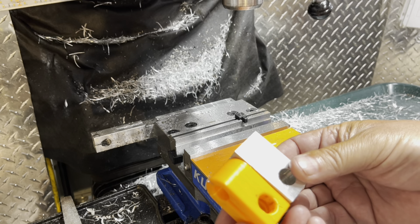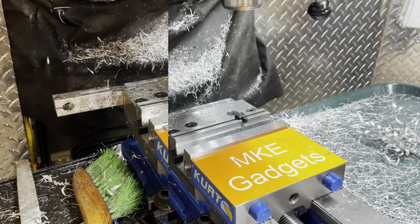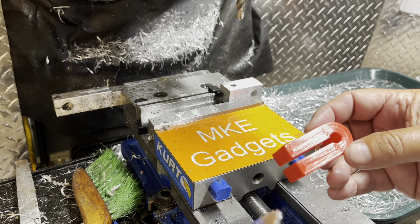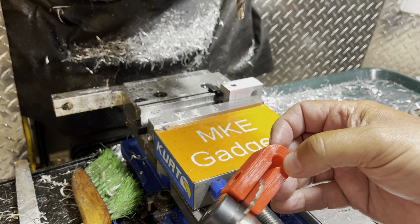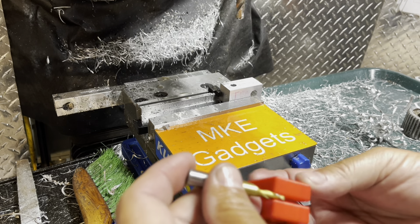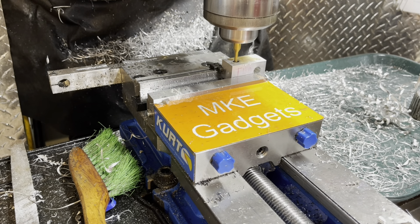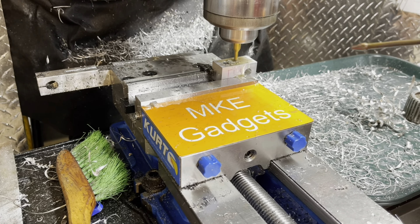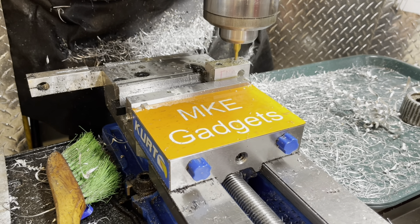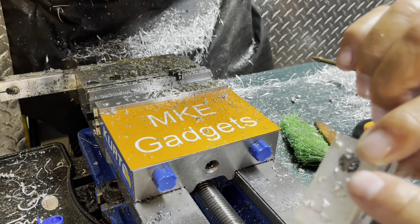So with that, I got the half-inch one done — drilled and reamed both holes. I'm going to set these two aside so I don't get them mixed up. The fun thing about designing your own parts is you can make them any size and shape you want. I didn't realize when I grabbed my slitting saw that I'm not going to reach that hole. So instead, I'm going to use a three-sixteenths, two-flute high-speed steel end mill and go in there and remove that stock. I'll only be able to get so far on this edge, then flip it over and hopefully make it all the way through. That turned out pretty well — I'm going to tap one side and drill the other side out half-inch, and I'll do that off-camera.